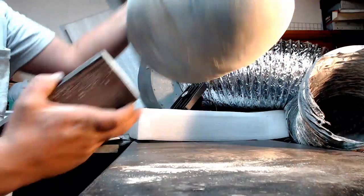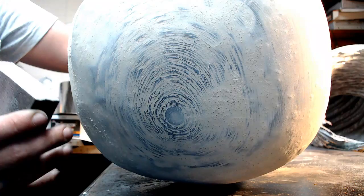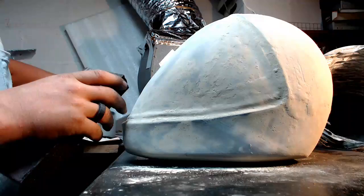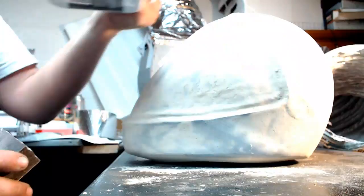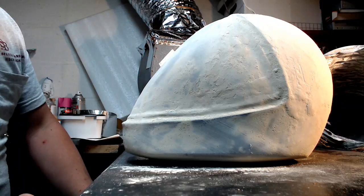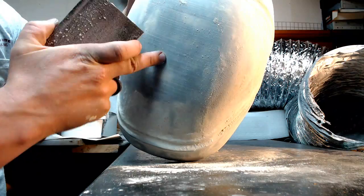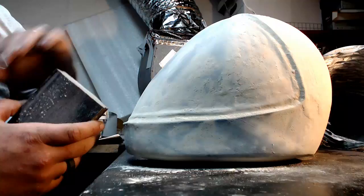I don't know if you guys saw it on Twitter or not. You can see on the top, there's a lot of filler in the grooves that was printed over top of the support material, using the ProBond wood filler. This stuff works pretty well for a real quick, easy cleanup. I put it on quite heavy because I was distracted as I was doing it this afternoon when I got home from work. Now I'm sanding everything down, and like you can see on the front here, I'm sanding it to the point that I can see the layer lines, but you can't actually feel them anymore. They're filled in, and any imperfections, this stuff's awesome.